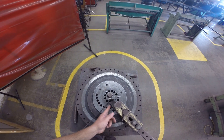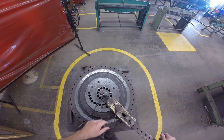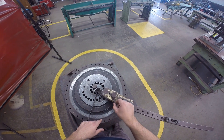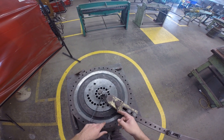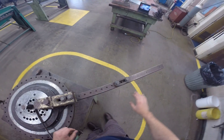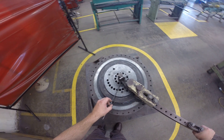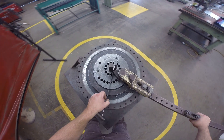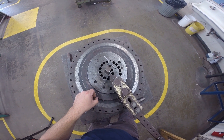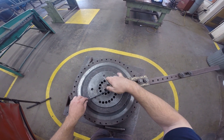On the diacro, I'm going in for a sharp turn, so I'm going to use the angular point. To make sure it doesn't swivel around on me, in the direction that I bend the handle, there's a stop right here. I'm going to turn the direction that I'm bending, which is towards me. To bend, I'm just going to grab the handle out here at arm's reach — makes it easier to get better leverage — and I'm going to pull this to a 90-degree angle.